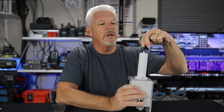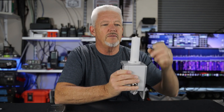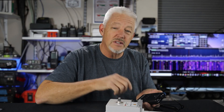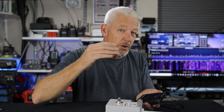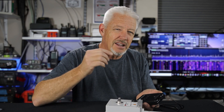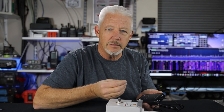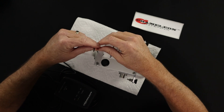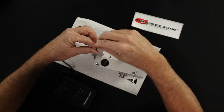On the motor itself is the power cord plug-in. Plug in this side first, then the other side goes right into the controller. In order to rotate the motor into the right spot for the next set screw, use the tune buttons to quickly find the spot, then the jog button to get it incrementally into just the right position. Use the up and down tune buttons to go clockwise and counterclockwise. A quick turn or two with the Allen wrench and you're dialed in.